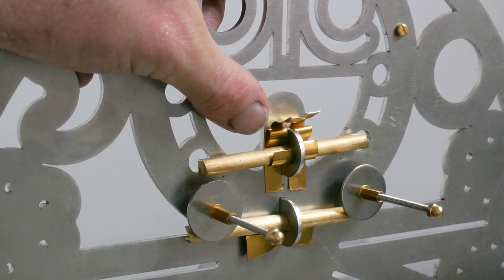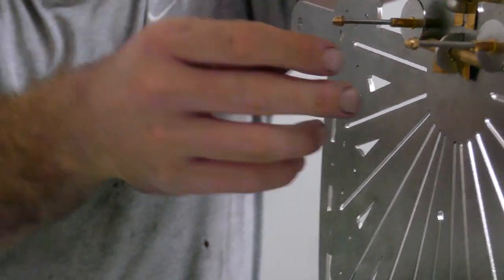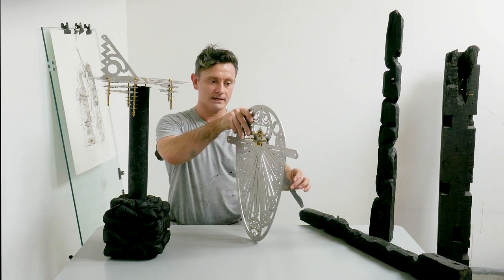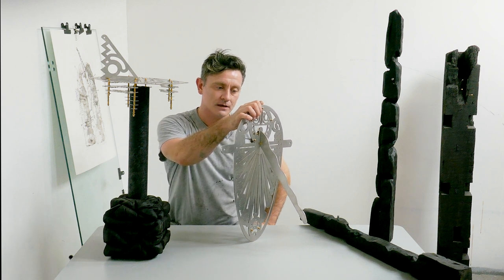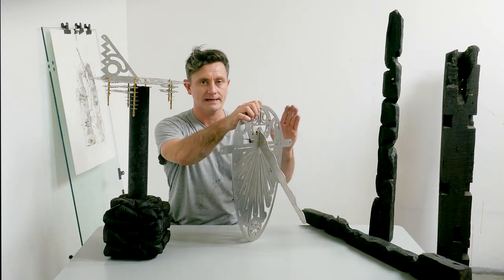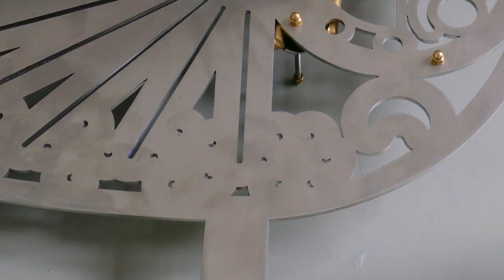The notion of using thin pieces of brass to wedge in came into play again here, and it's worked really well — it adds something elaborate but is genuinely functional. I've also added brass washers and brass bolts to pin everything more tightly, and as a result the whole thing is really nice and firm. It needs to go onto the two posts, but I won't do that until it's outside because so much of this relies on everything being perfectly horizontal and at the right measurement — it's best to do that all in situ.